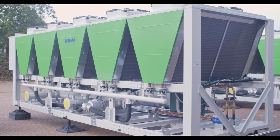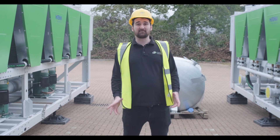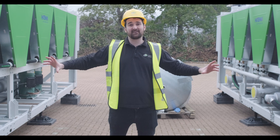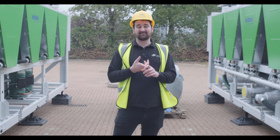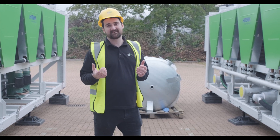So here we are at the chillers. These are half-megawatt chillers each. This is where the water from the data hall enters into a large header pipe, which will be sitting in front of me, into these buffer tanks - you can see one just behind me. That balances out any differences in pressure, flow rate, et cetera, with the different temperatures of the water throughout the cycle.